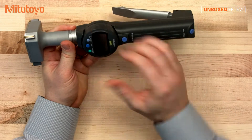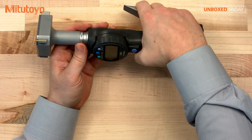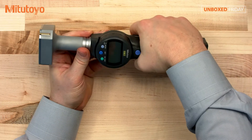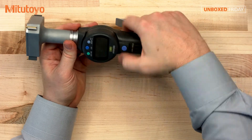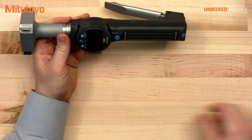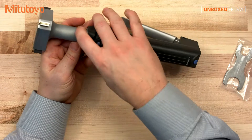Now this is one of my favorite bore gauges. The reason why I like it is you can get a fast, direct, easy measurement. This bore gauge comes with titanium nitride coated pins, so they're much more durable and wear resistant. It also has a nice hold button — so if you're using it at a tough angle, you can use that hold button to hold down the measurement. And this is the spot where you would use the wrench and see the little notches, to take off that adjustable head.